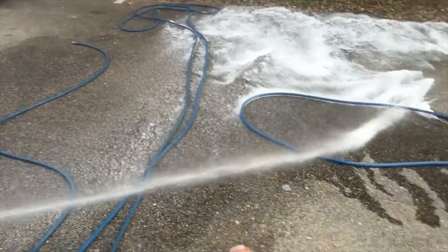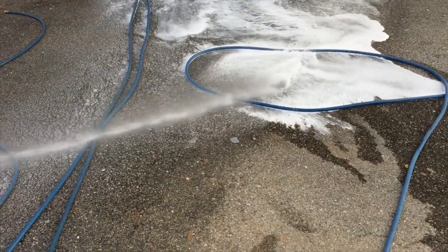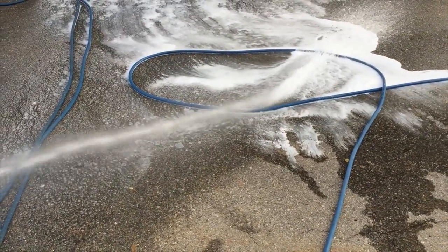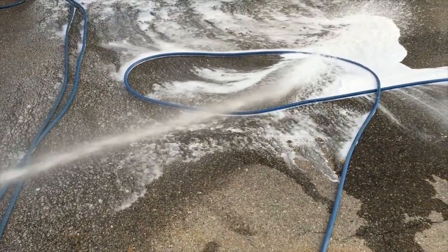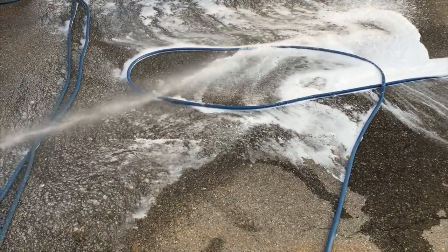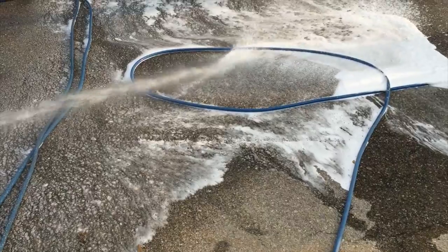Hold it down to the ground so we can show where that soap bumps. When the soap gets a lot thicker, we'll know that everything behind that is now 20%. We just introduced that glob of soap into the water — and right there the soap is getting a lot thicker, so we now know that we're shooting a 20% mixture.